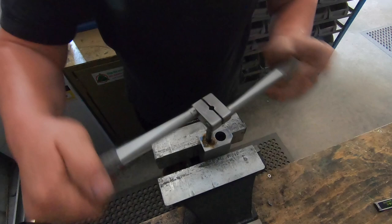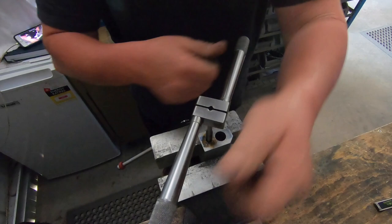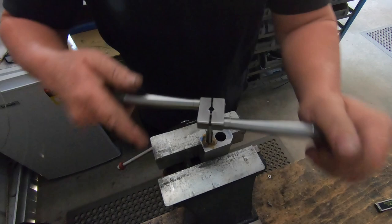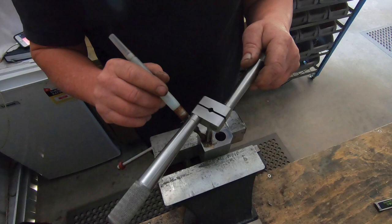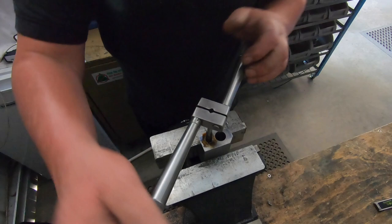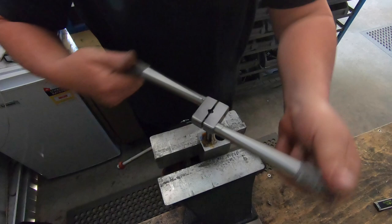I am one day going to buy a set of spiral taps and one day going to motorise that tapping jig I built. One day. But I've got to find a different chuck or a better system to hold the taps in the tapping jig before I go too much further with that. You just can't hold the taps tight enough. It's a real pain in the bum. Spend most of the time trying to keep the chuck tight. Come up with an idea one day.